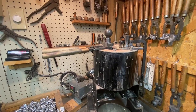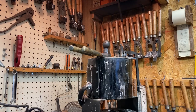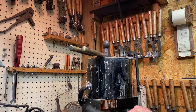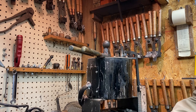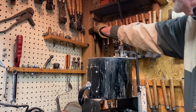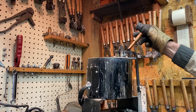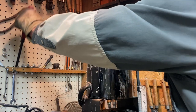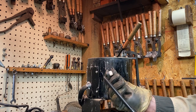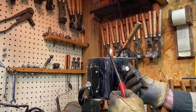You'll notice I have the mold sitting on top of the pot heating, and we're ready to begin casting. When you prepare for casting, the first thing you need to do is put on your gloves — the fire will be hot and the lead and everything around it is hot. The molds need to be moved out of the way. Get your dipper and put it in the pot so it has a chance to warm up a bit. The fluxing compound needs to be in not-too-large pieces, otherwise it'll flame up too much. Turn the fire on and drop it in.